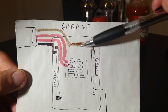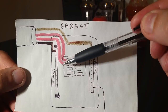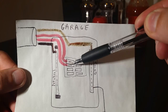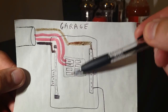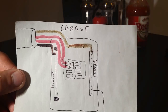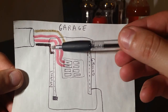This is the garage panel. The PVC conduit comes in here. The ground wire goes to the ground bar, and the two hots go to a 100 amp double pole breaker. This breaker should match the breaker in the main panel, and all breakers in the sub panel should be the same make — for example, if it's a GE panel, use GE breakers.